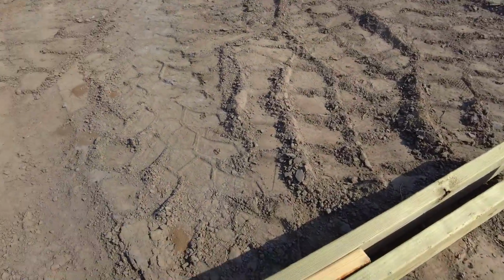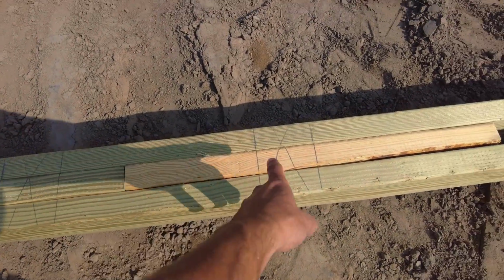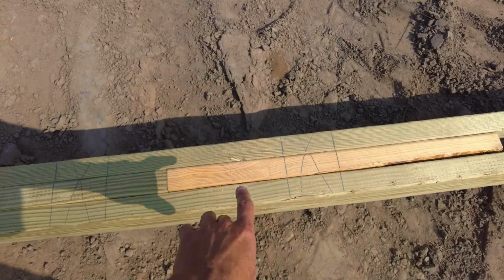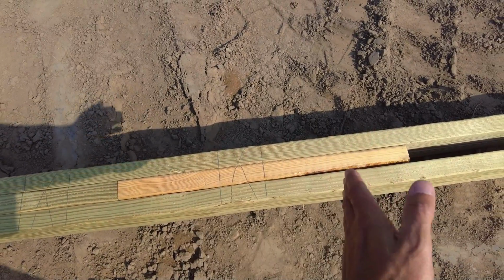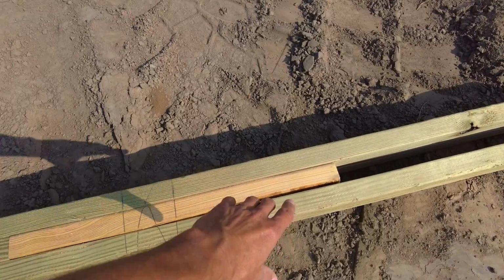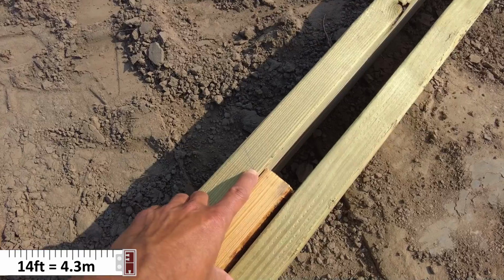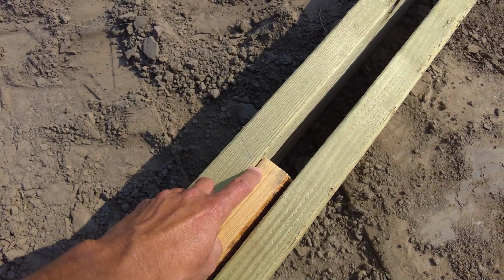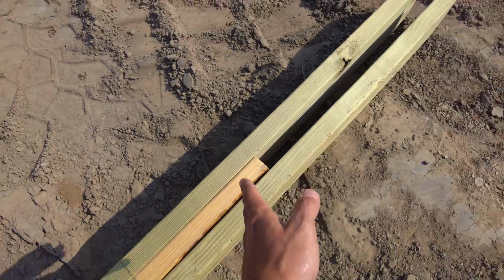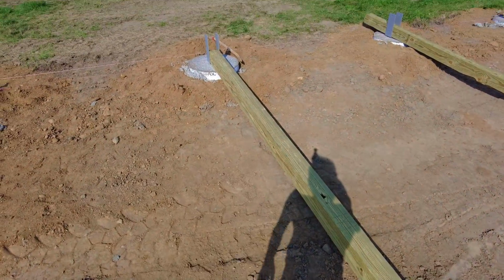And this piece here, which is pretty slick, since it's a laminated post, the center piece towards the top here is sent to us loose, so it can be removed, cut to whatever length you need, and then reinstalled. So here is the mark for a 14-foot sidewall, and all we did here was leave this middle part a 1/4 inch long, so that way this post is now a 1/4 inch longer and makes up for that 1/4 inch drop in the footing down there.